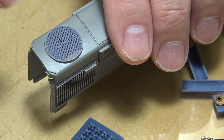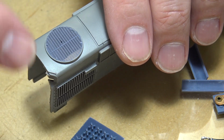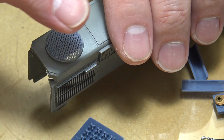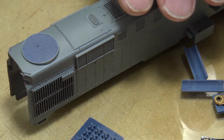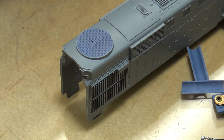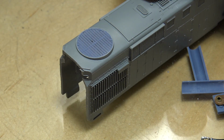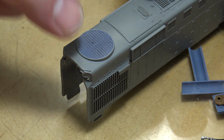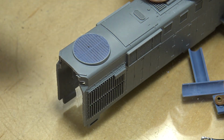Now what I'm going to do to make sure that this housing is perfectly perpendicular, the cut is perpendicular, is I bought a 670 thousandths reamer, and they're not cheap, but good. If you want to do the right things, good tools are worth their weight in gold.